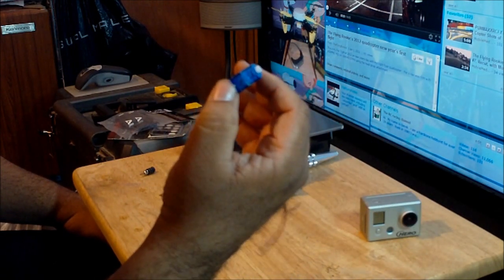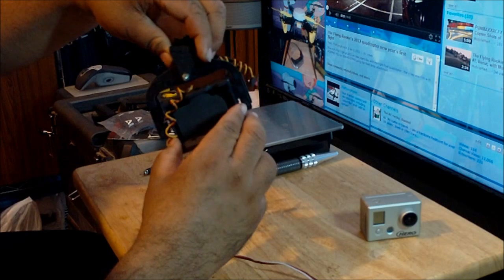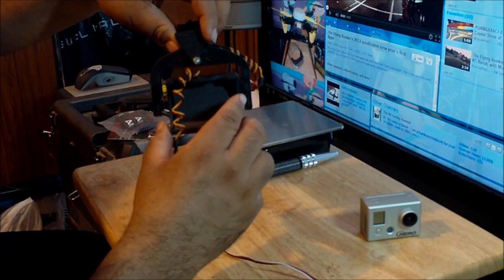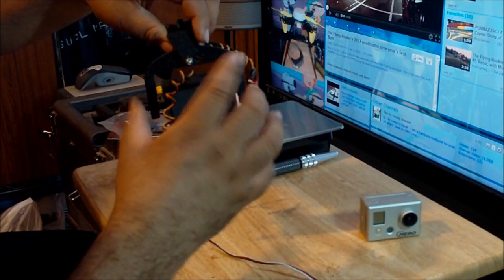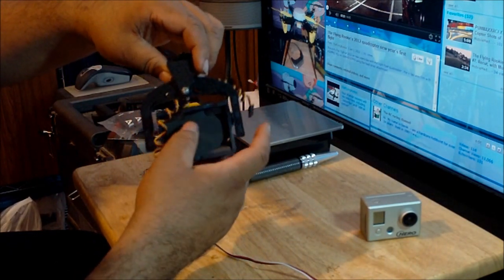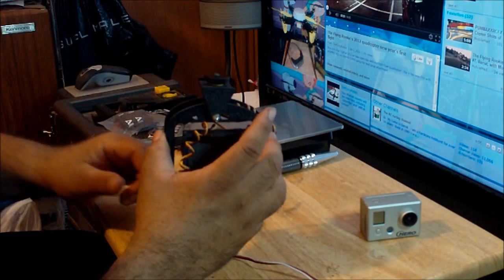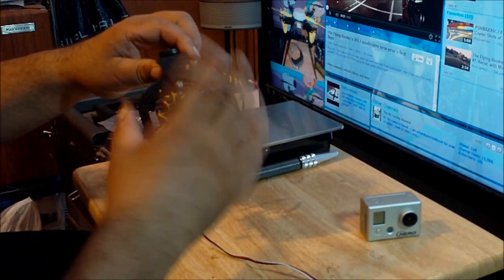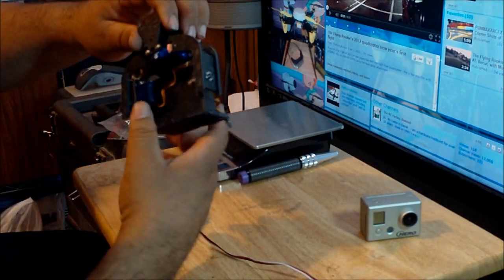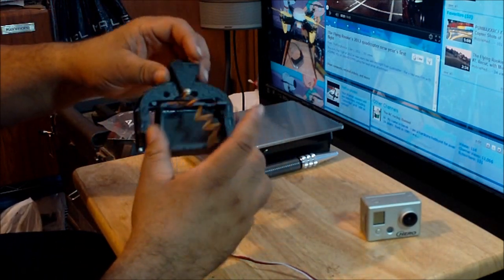And the problem with this is that the servo was reacting so fast to the changes of the angle where the quadcopter was moving that it was creating some inertia and it was jittering too much and it was uncontrollable. It looked like it had a nervous breakdown. I figured out that the way to go is putting really, really slow servos. So the solution was buying Hitec HS55 servos, and that pretty much solved the problem.